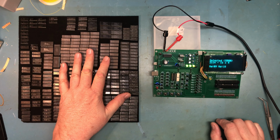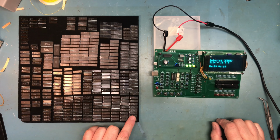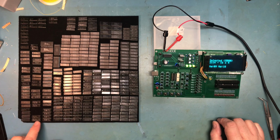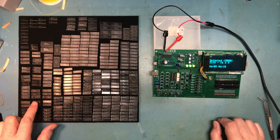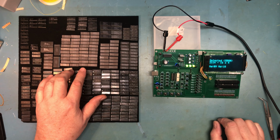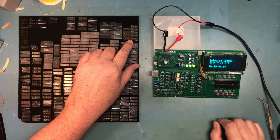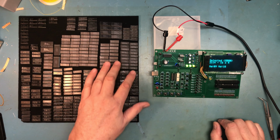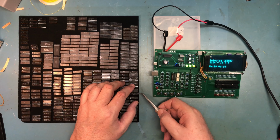So on the piece of anti-static foam here, I've got a bunch of National 2114s. 200 nanosecond, 200, there's some Intel ones here that are 400 nanosecond. Here's a couple of National ones that are 300, another National 300, more National. Those are 2102s. Those are 2147s. I don't remember what they are. Those aren't 2114s. There's a few up here, but I've got 8, 16. I think they're Signetics. It's an S from 1979. And these would be age appropriate, I believe.